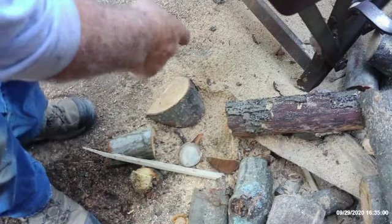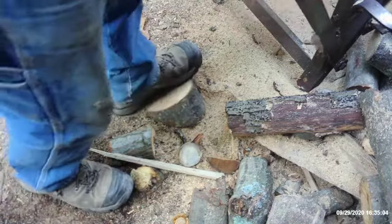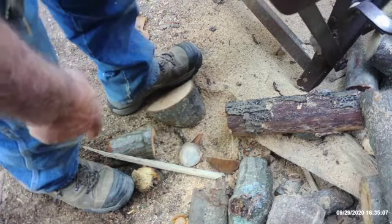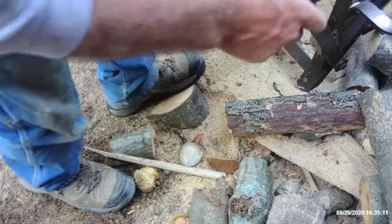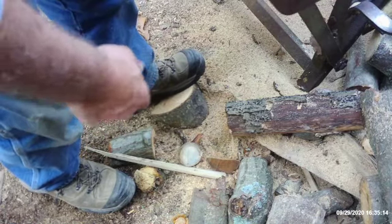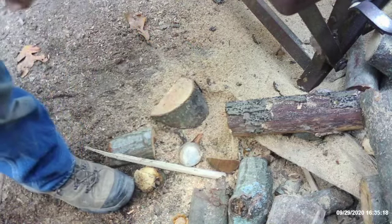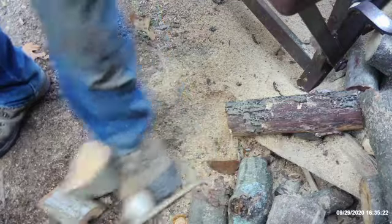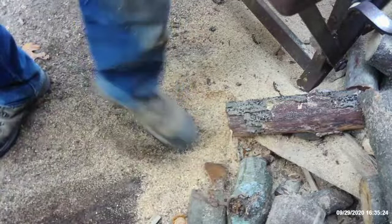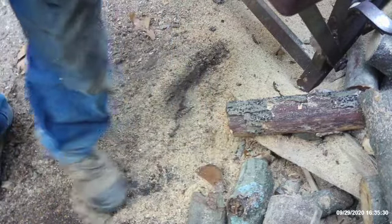You know those little sharp pieces that I've been cutting off at the end to kind of square up the pieces? This is where my foot is, right here. If you take a look, both of my feet are in contact with one of these little things. That's going to make me lose my step, or misstep, and create a problem, possibly slipping and sliding into the blade. So that's when it's time to stop, pick this all up, and then do the routine of kicking out all the stuff away from your feet. And make sure you've got a good clean area around your feet at all times.